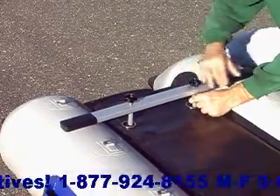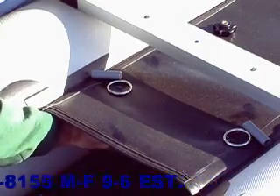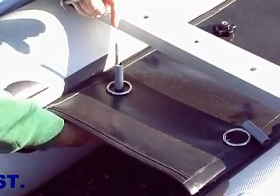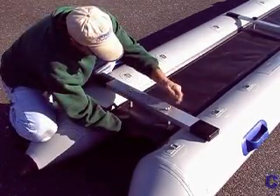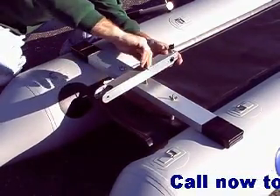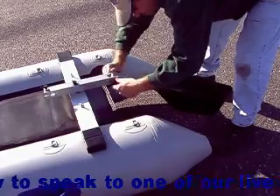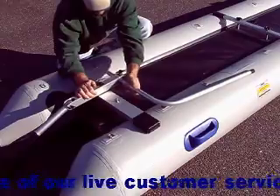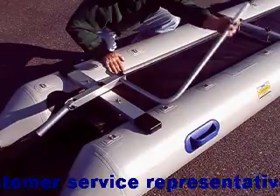The first step in installing your paddle ski sail kit is to remove the aft yoke. Insert the 5-inch bolts up through the lower crossbar and through the PVC floor. Place the rudder crossbar over the bolts and secure with wing nuts. Place the center section of the rudder over the crossbar and secure with the black wing nut — the rudder should pivot smoothly as shown. Attach the rudder blade to the center rudder section and bolt down with wing nuts. Slide the tiller arm into position and tighten with the wing nut. Do not over-tighten the tiller handle as the rudder still needs to move up and down.